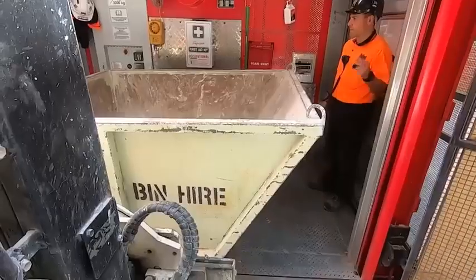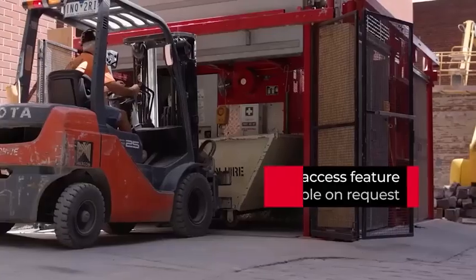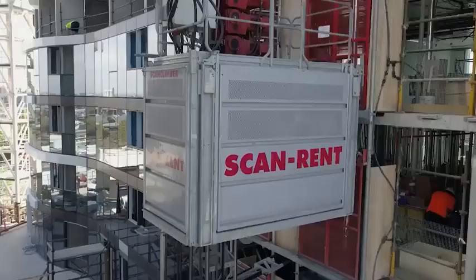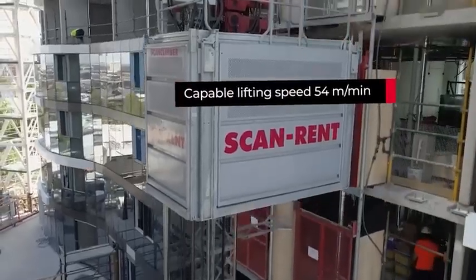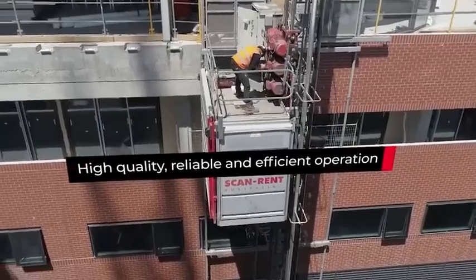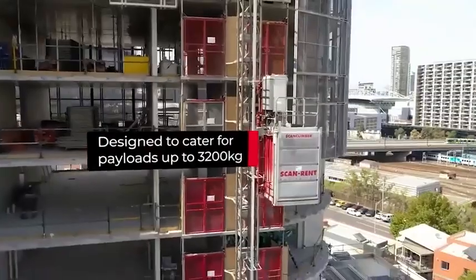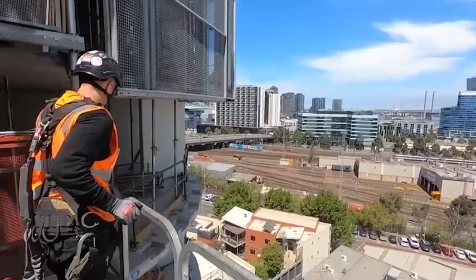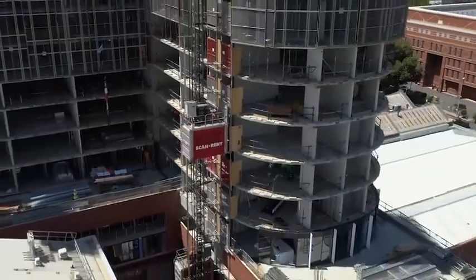For example, one of them is capable of lifting 7,050 pounds to a height of 984 feet at speeds of up to 295 feet per minute. The hoists are modular, which makes them easy to maintain and repair. They can be called to a specific landing level, like an elevator, and have a built-in computer that optimizes the route when needed at different levels.